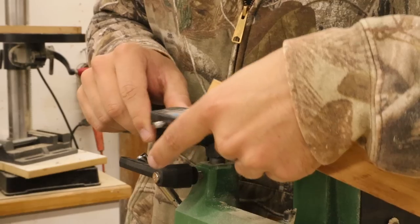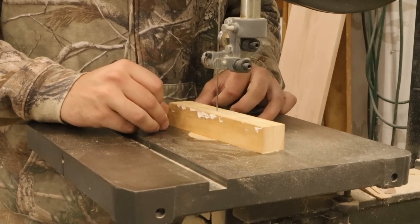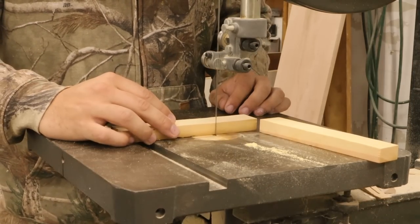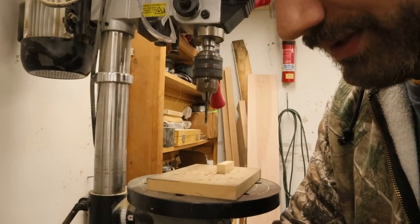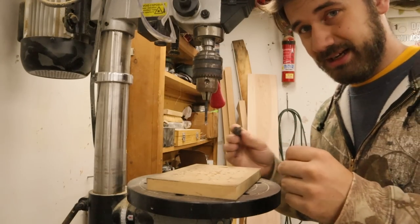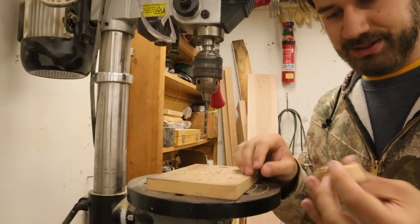How big is that thread? Quarter inch - okay good to know. I'm gonna cut this into quarters. The threads are a quarter inch so I need to go one or two sizes below that - let's go 7/32nds. That wood's kind of potent. It's a soft wood so we really want those threads to be grabbing something fine.